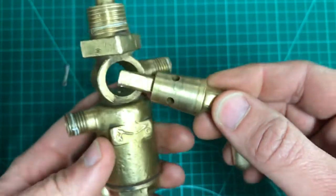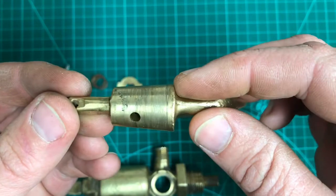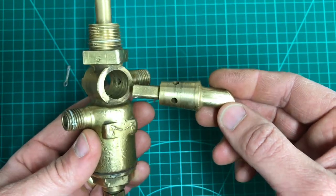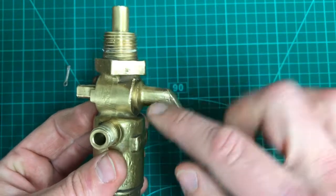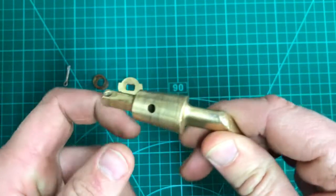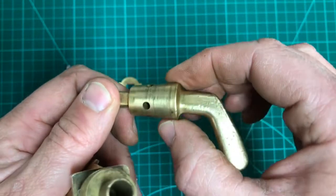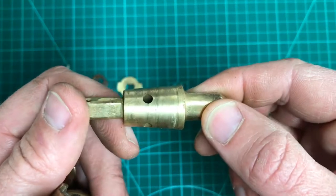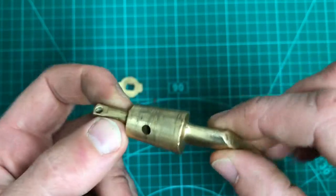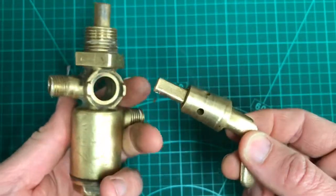What people try to do with these taps is lap them in with a fine grinding paste — like valve grinding paste — which is a big no-no on non-ferrous material like this. The grit just gets embedded in the tap and it will never seal properly once you've got scores running around it. The only way out of that now is to remachine both conical surfaces. I've done that on taps of this design before — you skim off as little as possible on both parts, take the finest of passes to clean the surface, then lap them together with a special non-ferrous lapping paste, which gives a really good contact area.